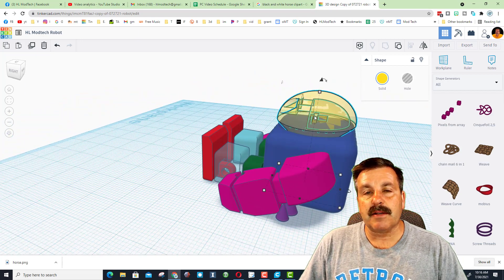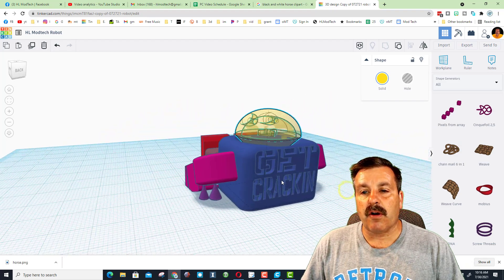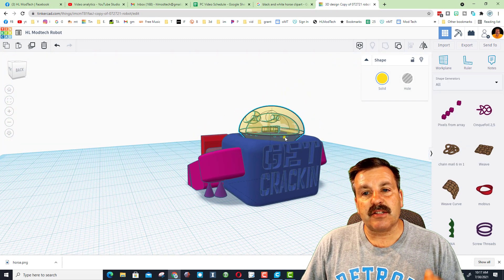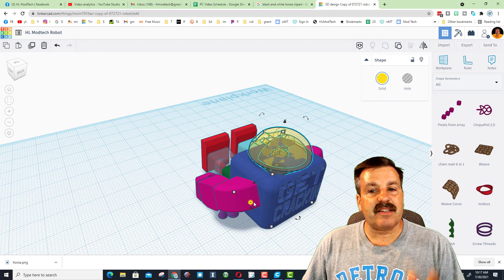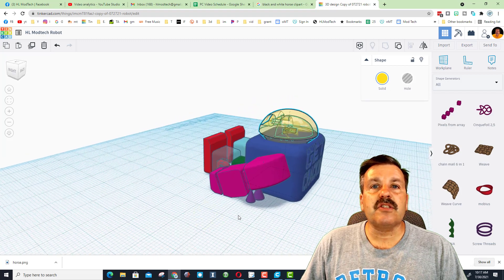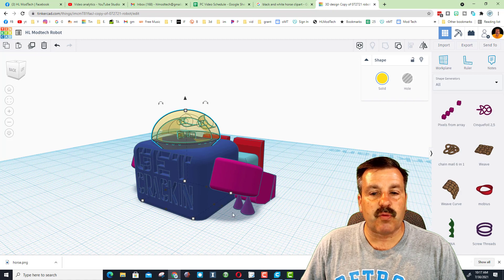There's also a piece up here, a cross that comes up. That gives it strength because for a long time I had trouble with this snapping off. This hole down here is added as well because it was sticking too hard to the bed and would snap the neck. By having less attached to the bed it's been popping off great. Lastly, I added these little cones right here, which made it less likely to happen without much wasted material.